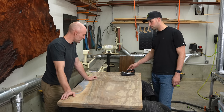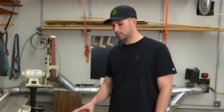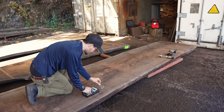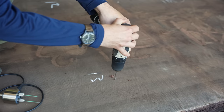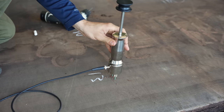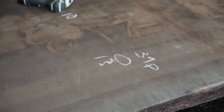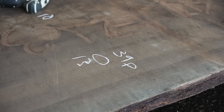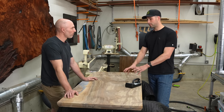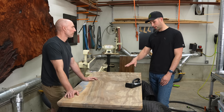So let's put it bluntly — how does this get out of your shop like this? 'Typically when we dry stuff like this we're checking the surface and pin-reading those wettest spots. But sometimes, being that we're dealing with old dead and dying material, trees get infected, which kind of limits the flow of water throughout the slab. So if we check spots and most of it's reading dry, we assume it's dry. Sometimes you'll have these isolated pockets — and in a situation like this, it's virtually all the way through.'